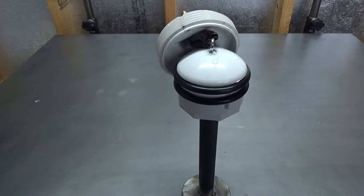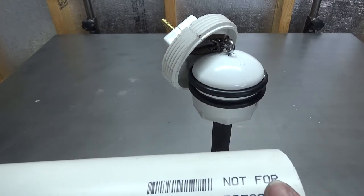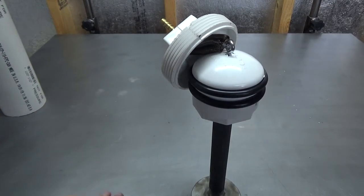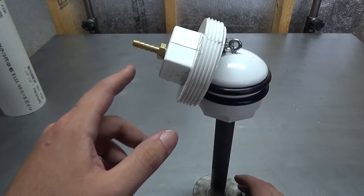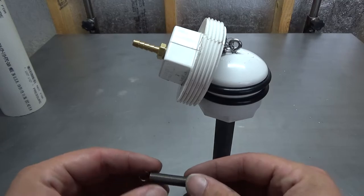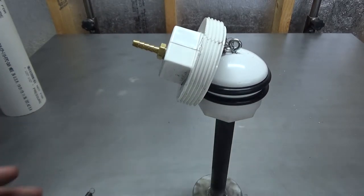One thing I wanted to address: this PVC says 'not for pressure' and I'm going to be putting pressure in it. I went to Lowe's and Home Depot and neither had two-foot sections of solid core PVC — I'd have had to buy an eight-foot section, which my cheap ass didn't want to do. However, I went to a local hardware store and not only found those one-eighth-inch NPT hose barb fittings I'd ordered online, but I also found solid core three-inch schedule 40 PVC. So the moral of the story: don't put pressure in foam core PVC because it'll be a pipe bomb, and support your local businesses.